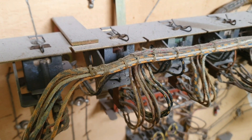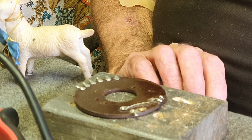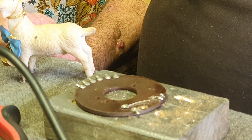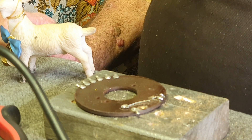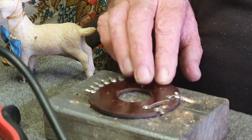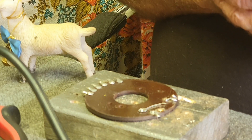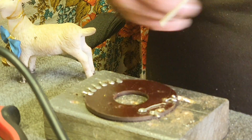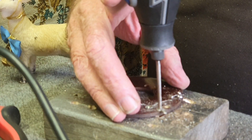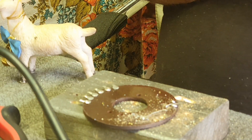We'll show you how we actually repair that disc. Here we are fitting the rivets to the Bakelite plate. The first thing we noticed is that this Bakelite plate is actually a little bit thicker than a Gottlieb plate, so the rivets don't poke through the hole on the other side quite as well. The first task is to drill the old rivet out. We've got a one-eighth drill bit and we're using our Dremel on low speed. We've already made a pilot hole with a center punch — here we are drilling that out and off it comes.